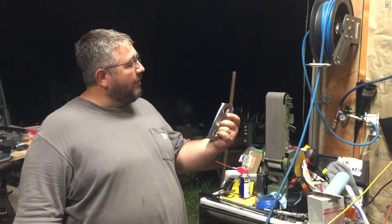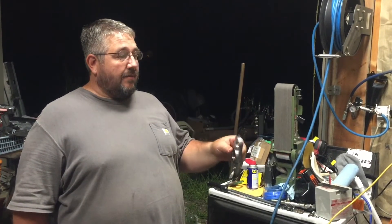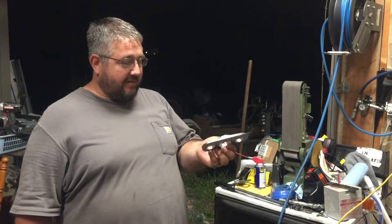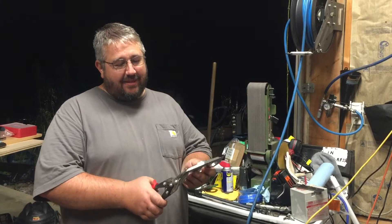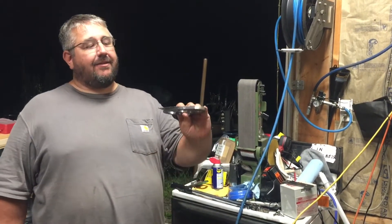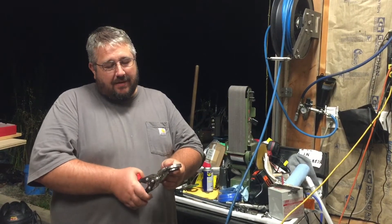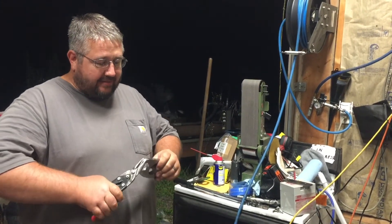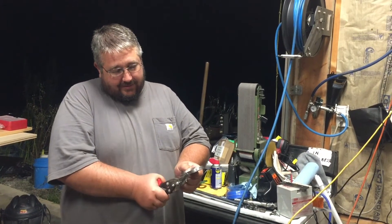We've got our part made. We had some problems machining the back side and getting rid of the waste material. We chucked it up and cut it as thin as we could, right on top of the vise. We thought about how to get it off, and spotted the tin snips — so we actually machined it thin enough that you can take tin snips and trim off the excess material, at least good enough to get it on the belt sander to finish polishing the edge. We are down to about 30 thousandths thick or so.